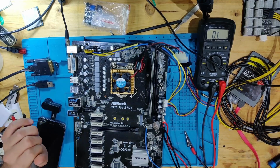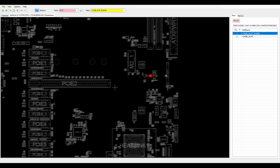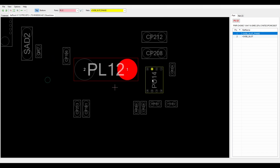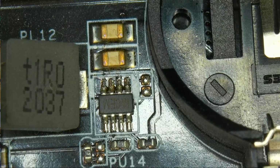To be very sure, I can show you the board view. I've attached it to the left side, and we saw that the left side has high resistance, and this side has the low resistance. The only thing on this side is this step-down converter. So what we probably need to do is desolder that step-down converter, see if our resistance goes up, and then supply our own 3 volts to it onto this pad, and see what happens. And right now you can see the controller.